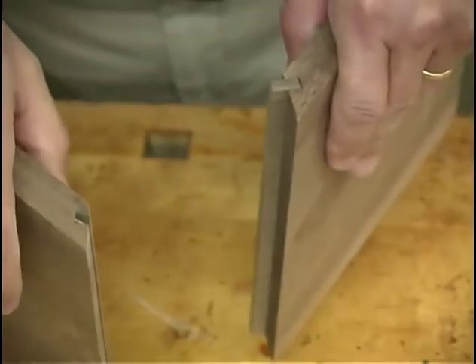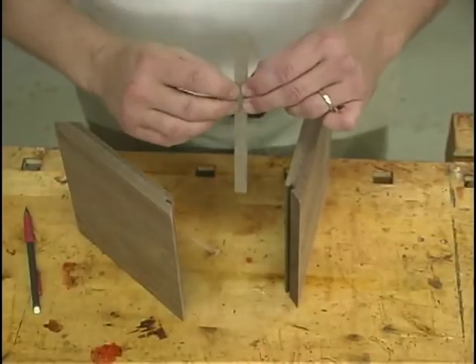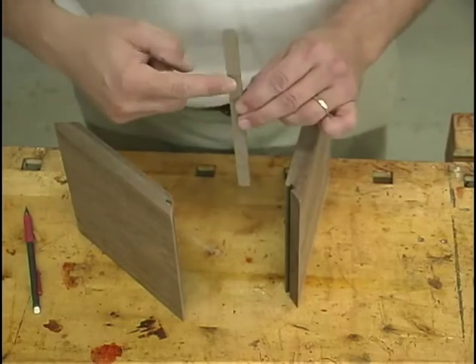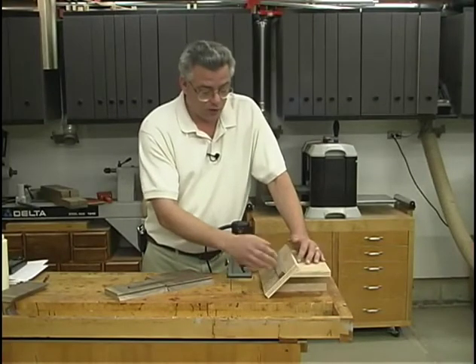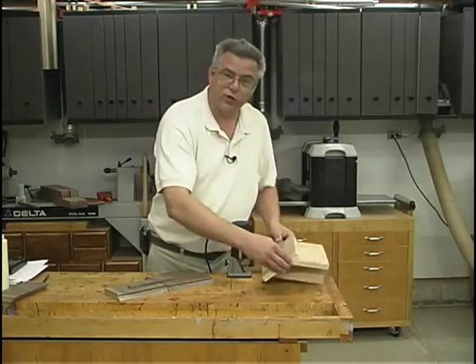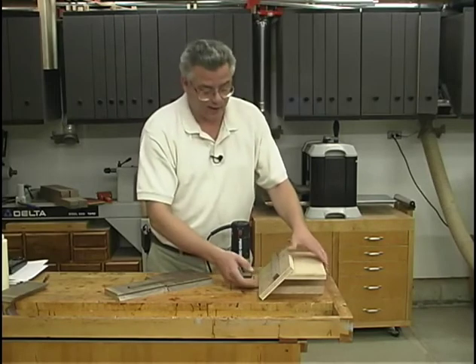You may be thinking, why can't I just rip a strip of wood long grain like we would traditionally do with a piece of wood? Well, that would create the grain running in the wrong direction and that would create a very weak spline. By having the grain run in this direction it's a very strong spline. This jig can work on any width stock — if you've got wider stock you'll just have to slide it down along the edge of the board, and narrower stock you can do in one cut.